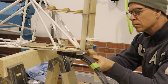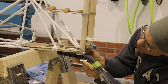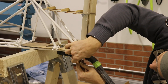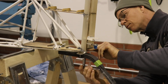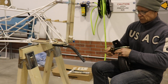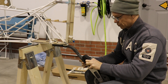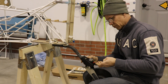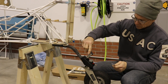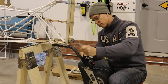Well, I looked everywhere for that plate and could not find it, so I ended up buying a new one from Kit Fox. It delayed me a few days, but I now have it, and this is the new plate I'm installing right now. There's a big hole in this tail piece where this bolt goes through, and that has to be opened up on a drill press. I didn't film it, but in that big solid chunk of aluminum, I did open up that hole to the proper size for the bolt. There's nothing tricky here — just tighten up the bolt and the tail wheel is done.